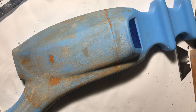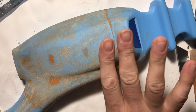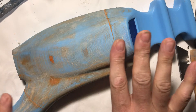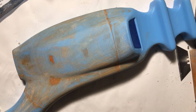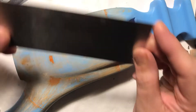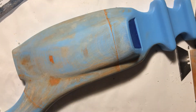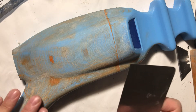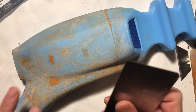I wanted to talk about something I just stumbled across — a really easy way to get a nice smooth finish on surfaces without much detail. I was rummaging around in my little workshop and I found this. It's a cabinet scraper. I used to use it for woodworking, but I grabbed it and was like, hey, I wonder if this would work on 3D prints — and it does really well.